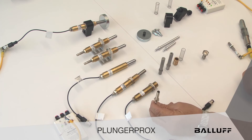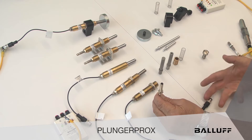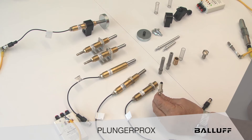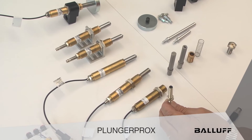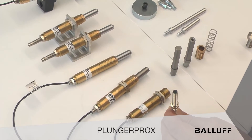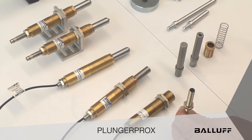What's the difference between this sensor and other sensors? Well, it's not flush — meaning you can surround it and embed it in metal — and it's not non-flush, meaning it has to be raised up above the surface pretty far to actuate. It's quasi-flush; it has to come off the surface of metal. It's married to this kit — you must use these sensors with these systems, either NPN or PNP, and when you buy it, it comes as a kit designated as such.